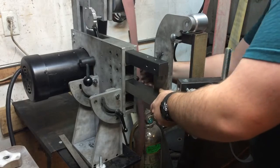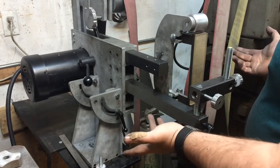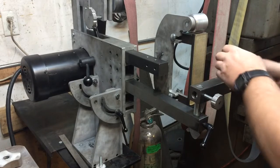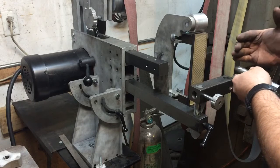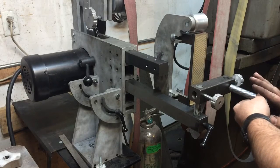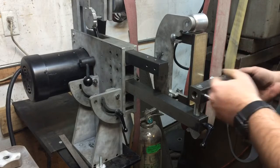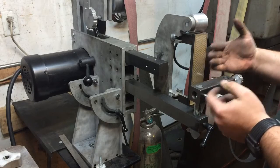Get just a little bit more height. Something like that. Another option I was playing with, some people like using a round bar as a tool rest. So if you imagine your table's here, you can just flip that up like that. Stick this out the bottom, and again, this will be centered better than that.